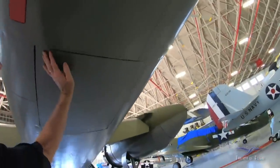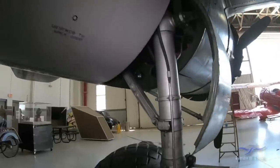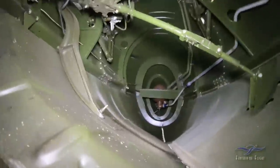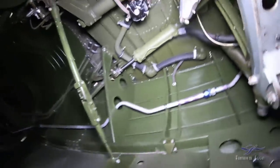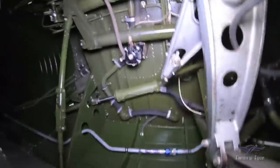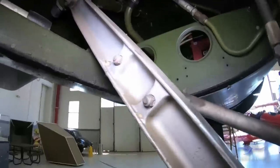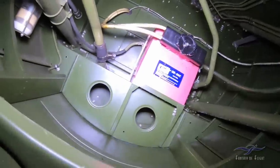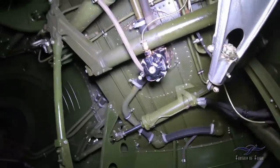Going down the steps, that is down. It's got a little bit of light here so I can peek up inside the wheel wells. You can look up inside there. Of course there's the landing gear doors that go in and out. That's the flap jack right there hooked up to that bell crank. That's the landing gear jack right there. Of course there's the landing gear, and there's a battery up there. That's fuel pumps for that outboard tank.